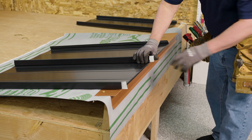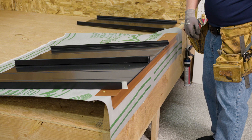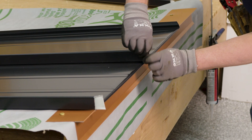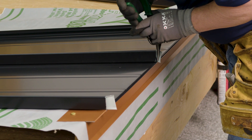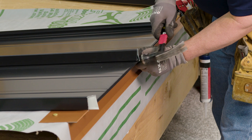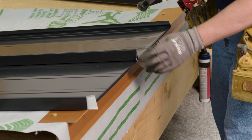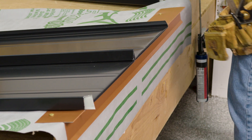For the end cap, you're just folding that tab over and then you can trace that, open it up or cut it off. It's just a real quick ending to help prevent moisture intrusion through the panel rib. Then we just give that a little tap — gently — not to mar the paint finish. Just get that finished off and capped off.